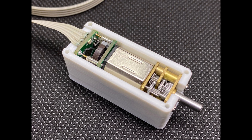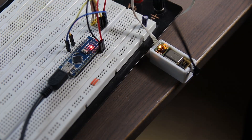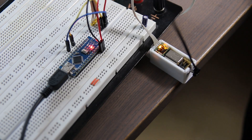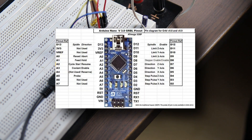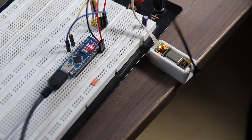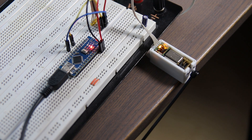So let's test if this really works. As a simple example, I installed GRBL — the mother of all motion control software — on an Arduino Nano as delivered. Looking at the pinout of the software, you can tap the step signals for the X axis at pin D2 and direction signals at pin D5. Then connect 5V to plus and ground to minus, and control the motor via the serial console.